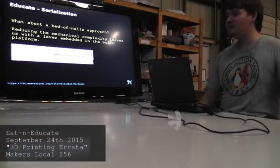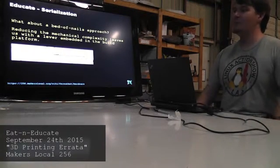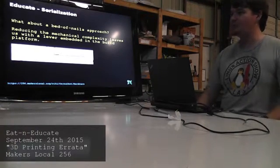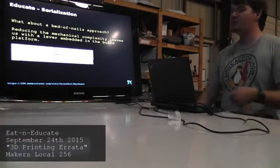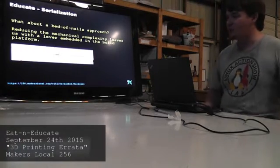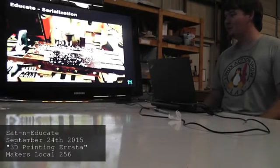And so when you simplify this idea so that it might possibly work, you end up with kind of a lever in the middle of the print bed, because the prints automatically center via software to the middle of the print bed. So you're pretty sure to get on one of the seams. If you move the lever, the print should come free. And we actually built this. I think several people from the shop helped with this endeavor.